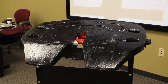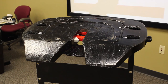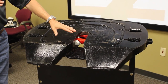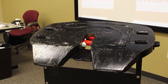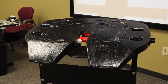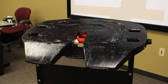This Holland fifth wheel is lubricated differently than any other fifth wheel on the market — it does not use black grease. It uses a penetrating oil such as WD-40. When inspecting the fifth wheel, if you see a lot of grease inside, that means it's gummed up and it's not supposed to be there. You will get some grease off of kingpins backing in, but if it is gummed up with black grease, it can cause it to malfunction. We clean these at every PM, but if you identify that it's gummed up with grease, get in touch with our breakdown department so we can get that cleaned.